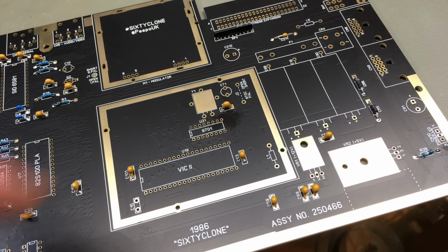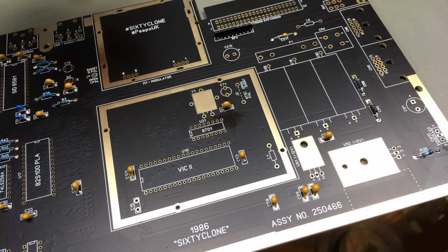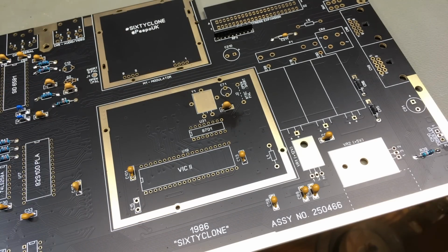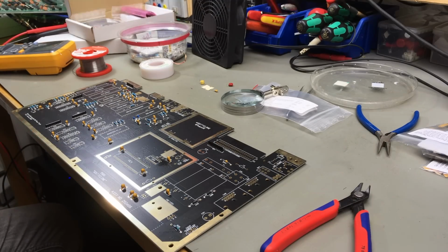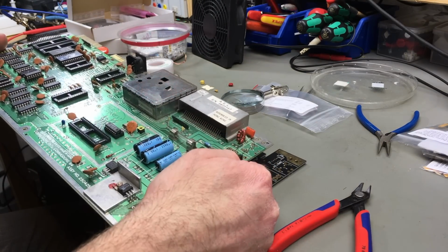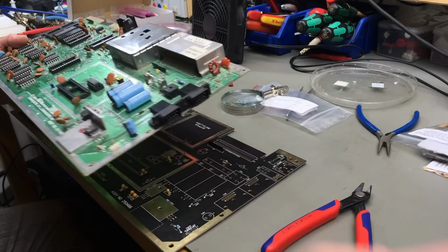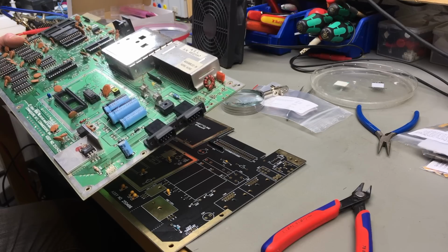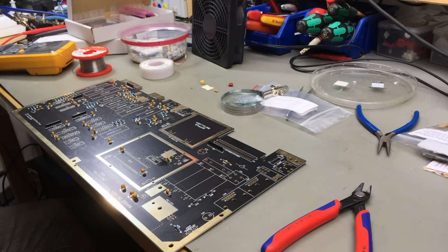So as you've probably seen in the time lapse, I had this populated with this one, which is apparently the wrong capacitor, I think. Otherwise it went pretty well so far. We don't have L5, I think we have to desolder this from here, which is an inductor. It's just a coil, 1.2 microhenry. And there's also another one. We have to salvage those, I think.